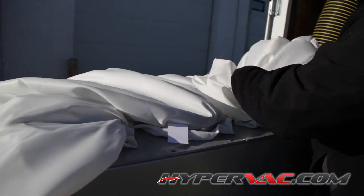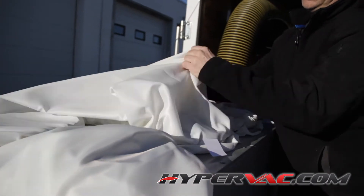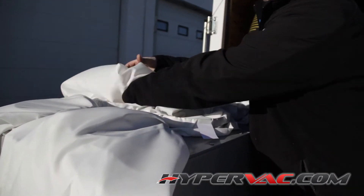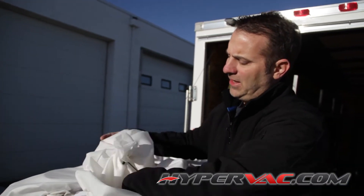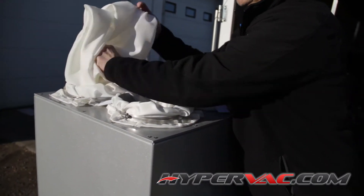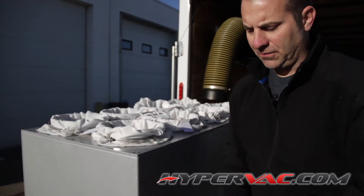When you're done with each job, make sure you put your filter bags back into the holes — it's not complicated. For the filter bags, you typically want to shake them out if they're really dirty and try to keep them as clean as possible. If you have to, even take them off and wash them periodically — some guys will wash them once or twice a year in a laundromat washing machine.